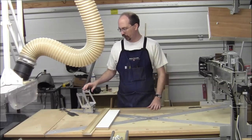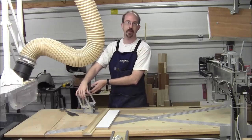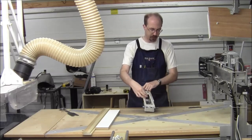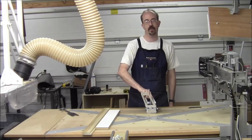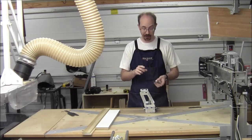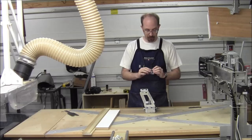Welcome back. This is probably the last — this is the final or completion video for the fret-slotting jig, rig, gizmo, whatever. This is it in its entirety, short of the blade. This mounts onto the carriage of the CNC router and it will sit basically like this. The router spins the shaft and turns a 90-degree turn with some spiral gears and spins a slitting saw. For those of you who didn't watch the videos — I realize there are about 10 parts. This would be the 11th, but this is the moment of project completion.